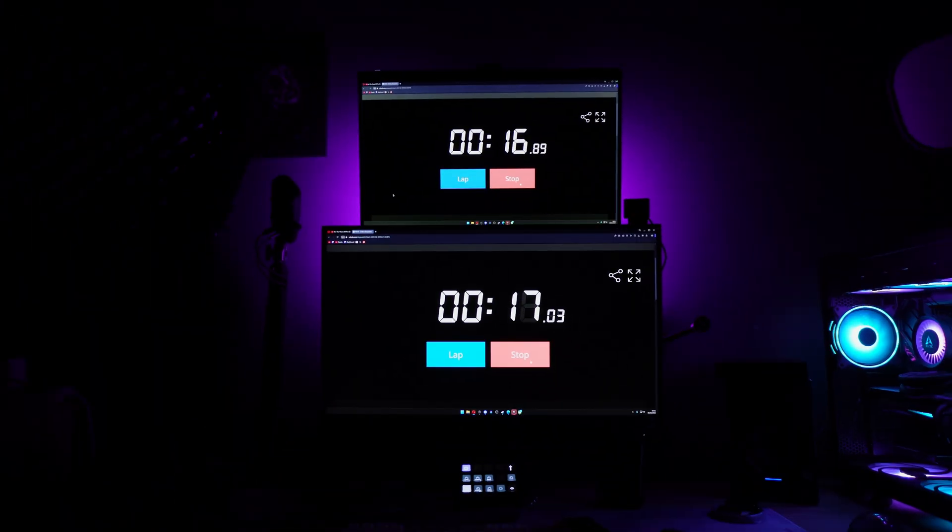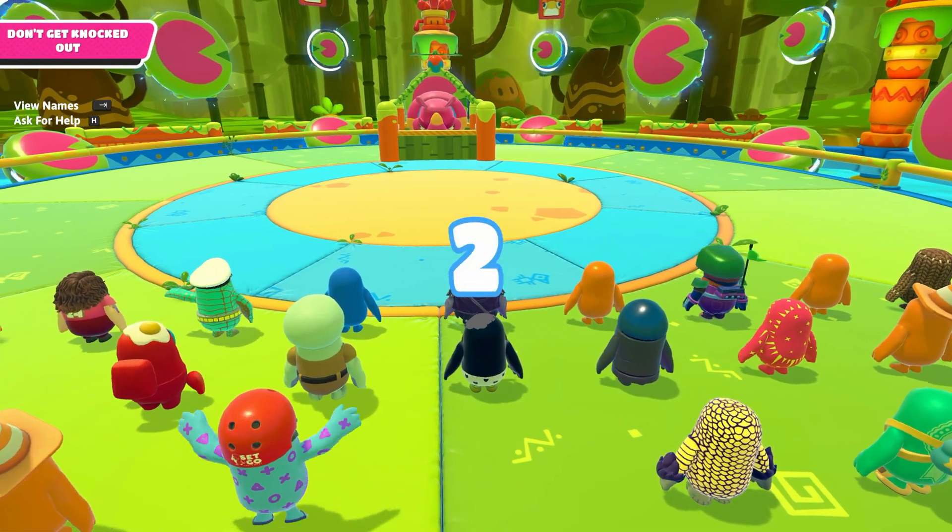When I paused and zoomed in to compare the time delay between both screens, it's about a tenth of a second — roughly 100 milliseconds. I would never recommend gaming on the preview screen from a capture card; you really do want to use passthrough. But in a non-competitive environment you probably could. Most importantly, that latency is not going to cause any noticeable audio desync between your audio inputs and the video on screen.